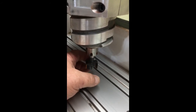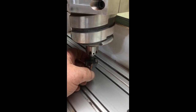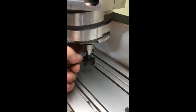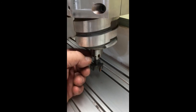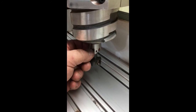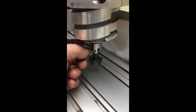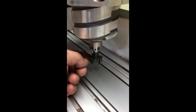I suppose if you spend hundreds of dollars on a blade, you might get one that's got almost no run out at all. Using a really good precise collet like this one from Think and Tinker really helps on your run out versus just using a regular chuck that you might get with your router. They're not very accurate as far as what you're trying to do for your CNC machine. So I really recommend that you have a really good collet system and buy a good quality bit.